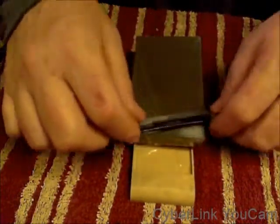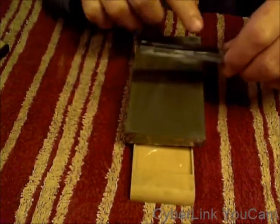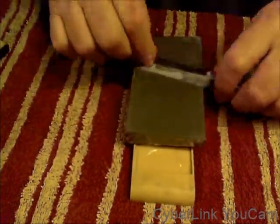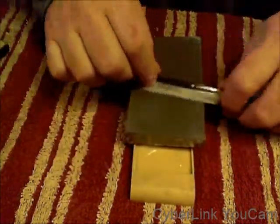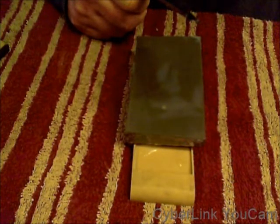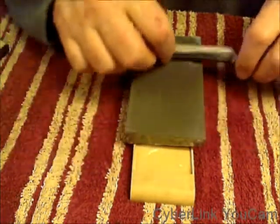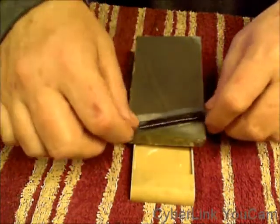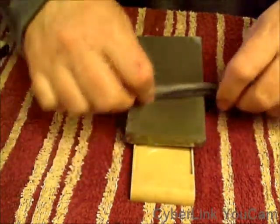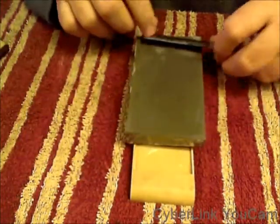And if you notice, you'll see me do this a lot. I tend to hone, even on this fairly straight blade. The spine curves just a little bit, but this is a fairly straight blade. I need to adjust the exposure just a tad. There. So you can see the stone better. But anyway, I don't remember what I was saying. Oh, you'll see a lot of times I'll do this number here. Even with kind of a straight blade, I'm honing toward a smile.